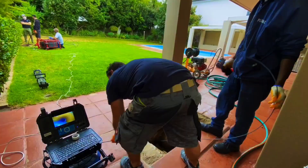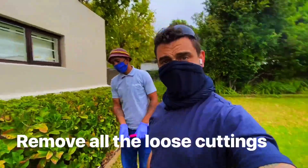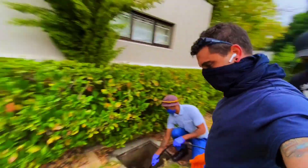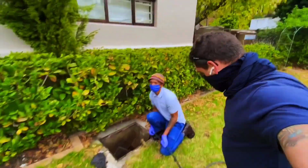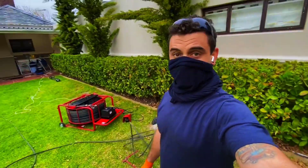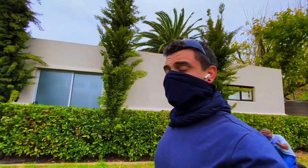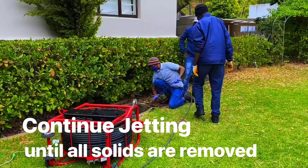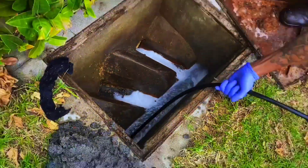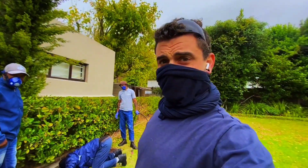The concrete comes out quite easily in this drain. Bringing in the jet again just to move the heavy stuff. The Maxi has eaten through the concrete that was sitting on the floor of the drain. We just need to move it along with the jet to bring it to the manhole so we can get some hands on it and pull it out of the drain. Preparation is the most important part of the job. It looks like we can probably build a house with all the concrete that's coming out of there.